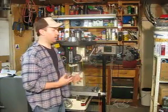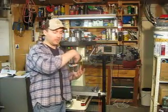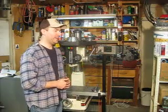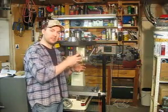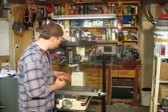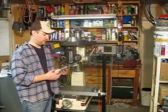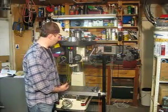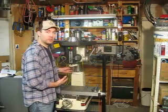Now, if you're using a metal machining cutter — a lot of people use just kind of cheap sliding tables and cheap drill presses and chuck some sort of a milling cutter up in that and try to use a drill press as a metal machining machine. And the results are never good, because the cross slide table has too much play in it, the drill press quill has too much play in it, and quite frankly a Jacobs chuck is not made for that. It just doesn't have the precision and accuracy of collets. So generally speaking, a collet is what you use to hold a milling cutter in something like this, and that's what I'm going to be using today to cut my jigs.